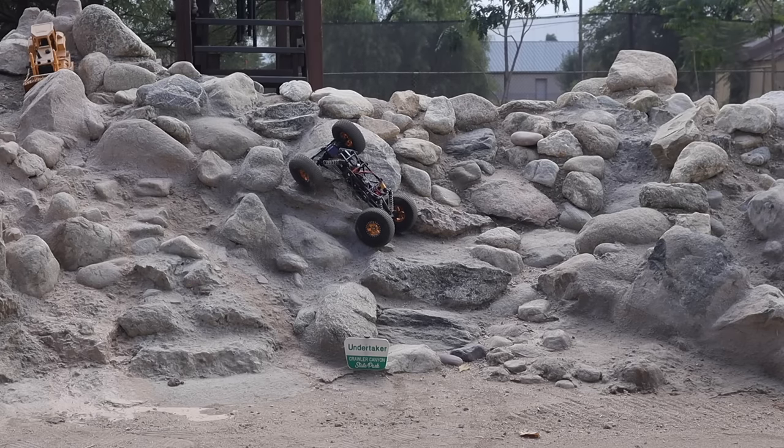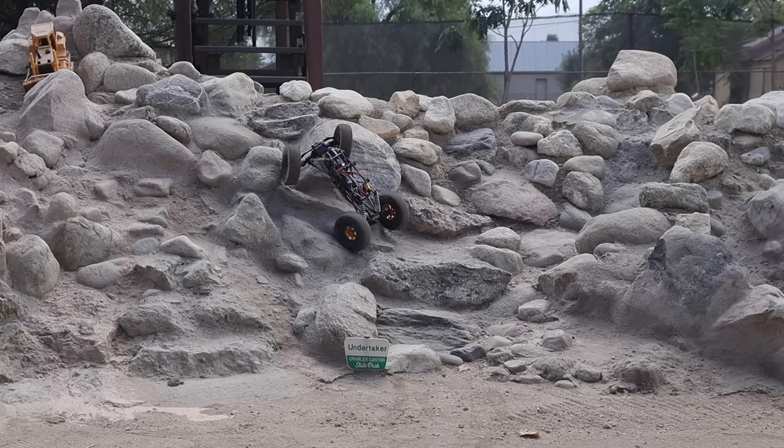Yeah, so ordinarily, when you apply dig, you're able to spin the other end around. Because when you're in dig, the rear axle and everything is locked, and only the front axle gets power, meaning that when you're off power, it can kind of free spin. But we have no free spinning here. We're mechanically locked. So dig doesn't behave exactly how it does on any other thing that I've used dig on.